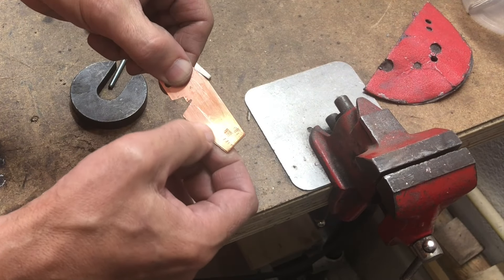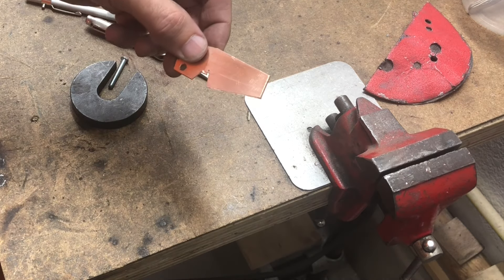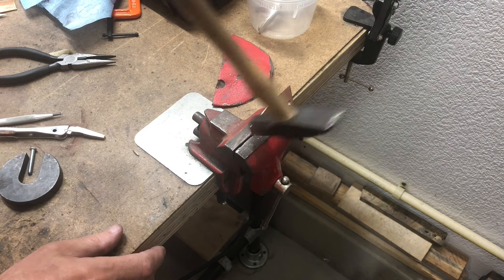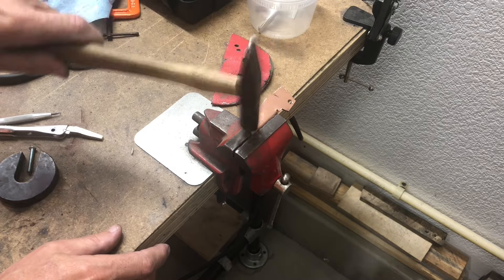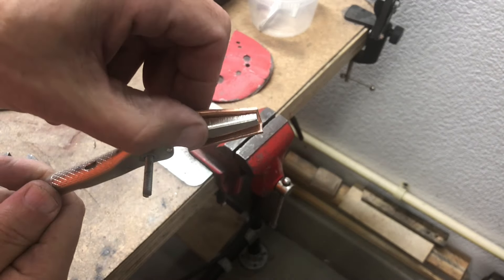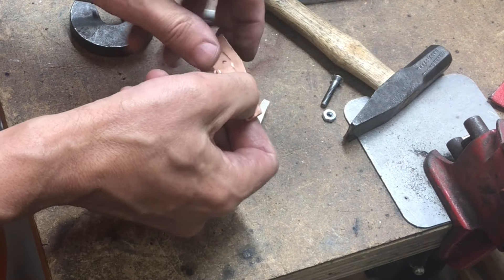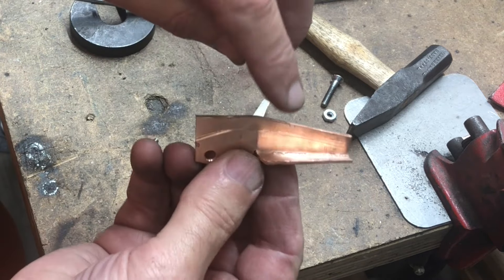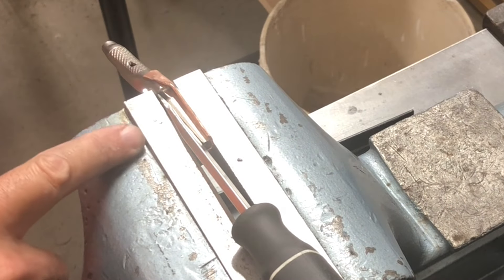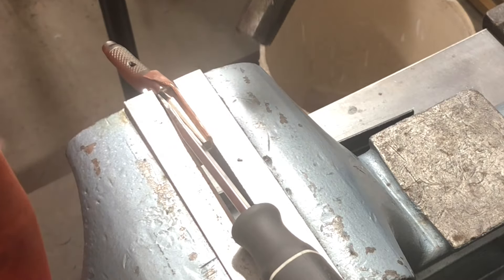The most critical fold is the one that goes under the jaw — obviously that's where the conduction takes place. I'll do that in my little hobby vise. Test fit number two — there's the little copper jaw. Let's go to work forming it on that scribe line. I moved over to the big vise and wedged it in with a screwdriver so I could finish forming this rather small element.